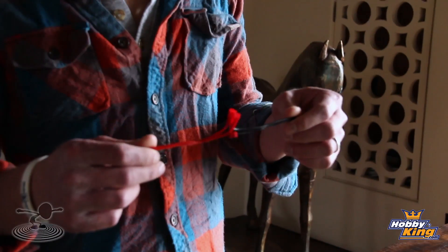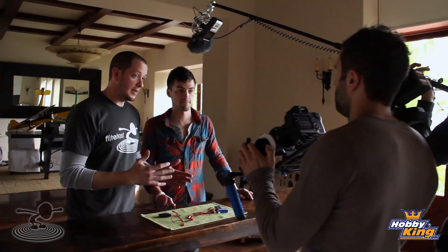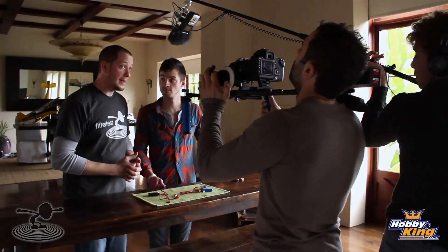Let's recap — I'm going to test you. Show me the parallel. The parallel is cool because it gives you more capacity, but the same amount of volts. Now, what about amperage draw? A 2,200 milliamp battery pack with a 20C rating gives you about 44 amps draw — that's about the maximum draw you want. If you have two in parallel, you're still going to only get 44 amps of draw — you just get double the capacity. With series, you get double the voltage and increased amps, but you don't get more capacity.